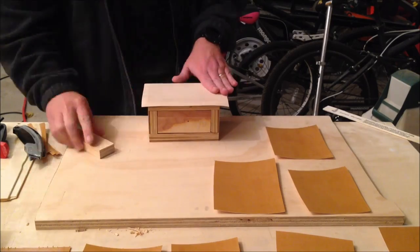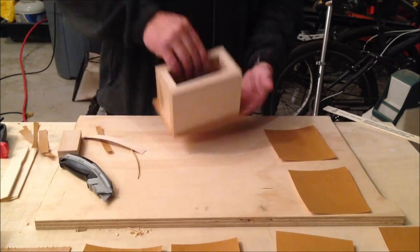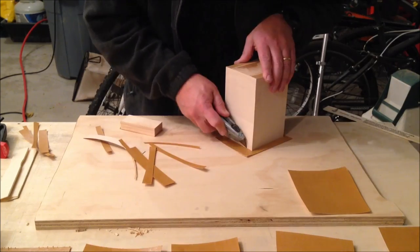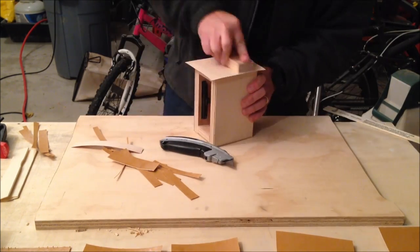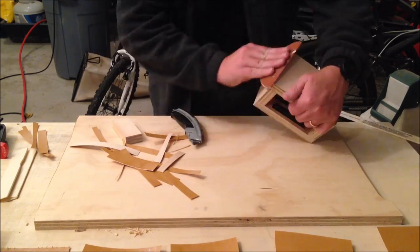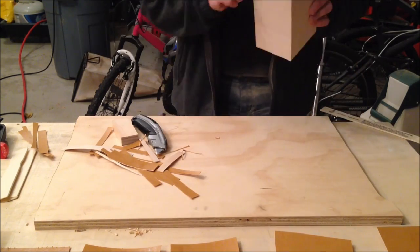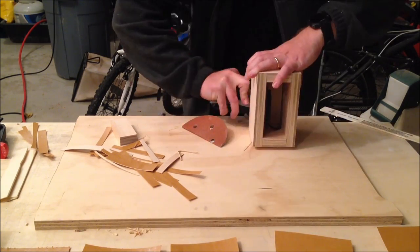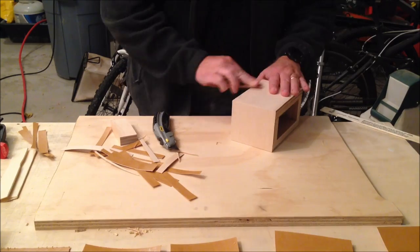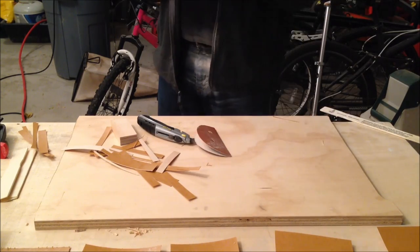All the pieces are cut oversized so you don't have to perfectly align anything. One tip: when you trim it back to size, leave a little bit extra instead of trying to cut it right against the edge, then sand it back. I applied veneer to all of the sides and then did the front last. It went really quick and it was really stuck — I was surprised how well the contact cement works. It's my first time using it and I'll definitely use it again. I took some 220 sandpaper and sanded all the edges back very carefully so there's a nice tight corner on the veneer. You can't see the paper backing at all on the corners — it really just looks like one big chunk of maple. I was also careful on the grain orientation: the grain on the front runs right to left, and on the sides it runs front to back, so it kind of just turns the corner nicely. I spent quite a bit of time carefully sanding the edges so it was a nice smooth transition and you couldn't get a fingernail hooked on it to pull off the veneer.